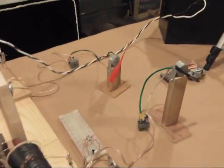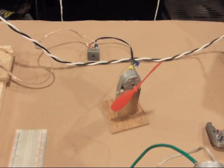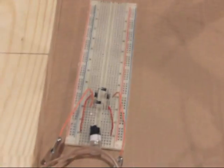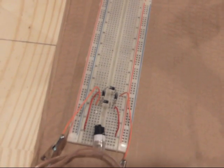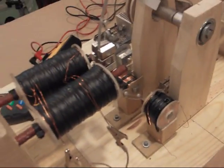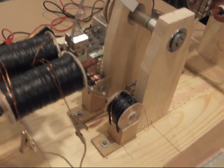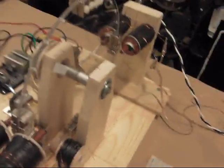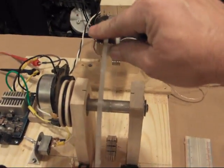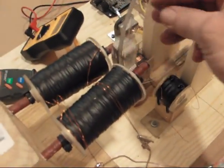On the output side I've got two little DC motors with some propellers on them so you can see they're running. And there's a bridge rectifier — it converts AC to DC, and there's one on the breadboard. It's four diodes turned in the proper direction to convert the AC into DC direct current. All AC generators are AC internally. The AC generator output has to be converted to DC right off the bat. The reason for that is because you have a magnet with a north side and a south side. In order to create a pulse of electricity you have to isolate that — the next time it has to be a south and a north, and each time one of those goes by, it creates an opposite field.